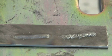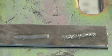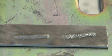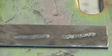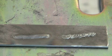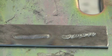If you're seeing little pinholes in your welds, that's an indication that you need to either clean your MIG nozzle out, because your MIG nozzle will tend to get a lot of spatter stuck in it. You can dip the nozzle in nozzle dip and it'll keep the spatter off. But if there's too much spatter on there, it'll restrict the flow of gas coming out of the nozzle, which could potentially lead to porosity in your welds.